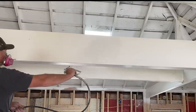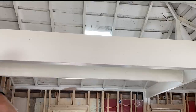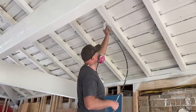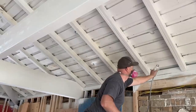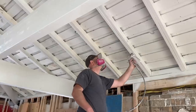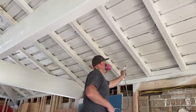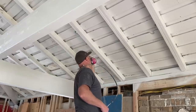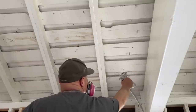At this point it looks like I'm just painting white over white, which technically I am because the primer was a nice bright white color, but it is a little bit yellowy — the camera's just not picking it up very well. When I'm actually looking at it in the room, you can see this yellowish tint that came through from the tannins in the wood. Now that I've primed it with the Zinsser shellac, it's all going away and it's a nice bright, crisp white. The water stains are really bad in this section and two coats of the shellac work like a charm.